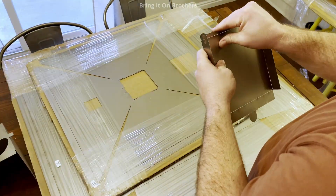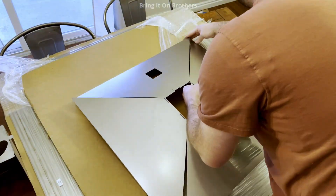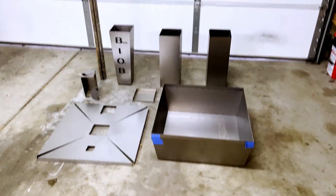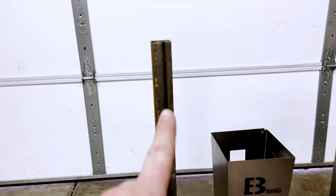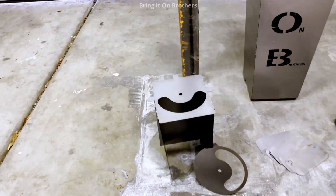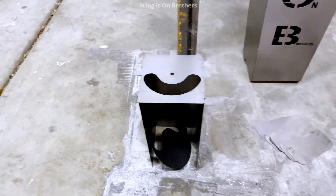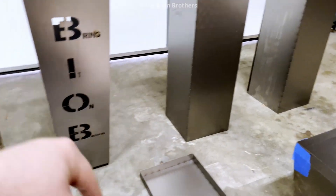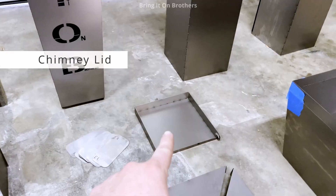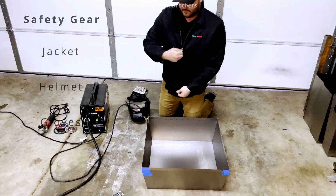The weakness of current smudge pot designs is they're big, bulky, and hard to get around. Here we go — all the different pieces. These two tubes are the chimney extensions, and this is the base of the chimney. This piece of steel I'm going to use for the return. This is the air intake and funnel to make sure we don't get any fire trying to go out the input. These are mating plates that will be welded to keep the chimney interlocked. This is the lid to cut off the chimney. This is the base pot and lid. Let's get started.